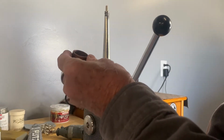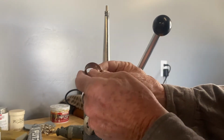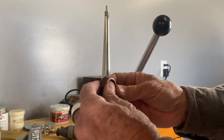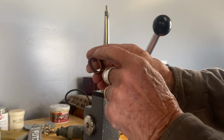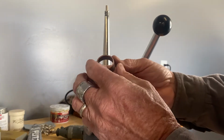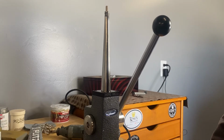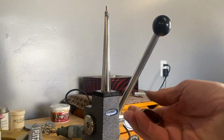And then it looks like we might put it through the Swedish wrap a little bit just to try to get rid of some of that bow. So I'm going to stretch it out just a little bit more on the mega stretcher. And then it looks like we might have to go to the Swedish wrap a little bit, because I want to get some of that bow out of it before I start reducing it to size. So let's do one more time on the mega stretcher and then we'll put it through the Swedish wrap.